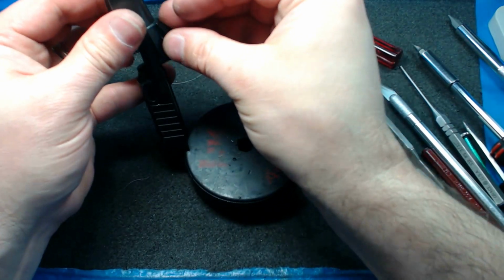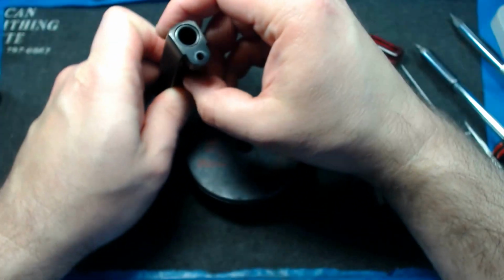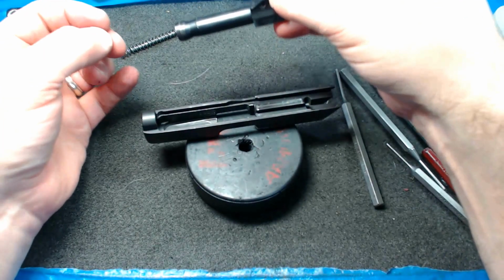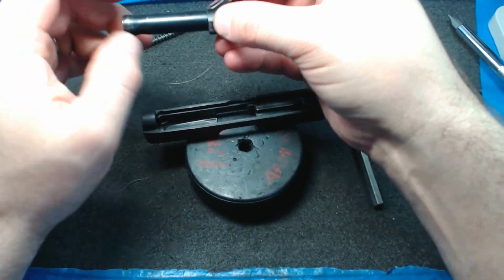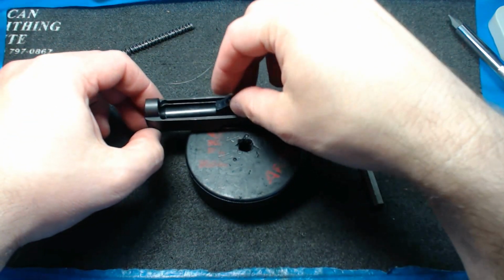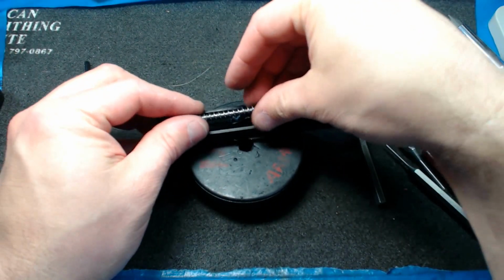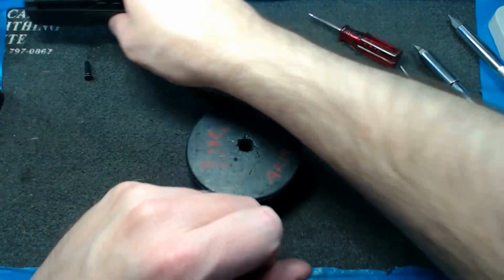Basically, it lets you make it so that this has a much tighter seal to the slide with no actual play, or very little anyway, compared to if it were a perfect cylinder. The shorter your barrel, the more important something like that is. Once you get to a 4 or 5 inch barrel, then yeah, you're not moving it enough to make a difference, but they still make 1911s with match bushings that are really tight there and have a slightly wider end for just that reason. But again, with that bushing, there's not a lot of tipping going on at that point. So anyway, in order to make it so you can actually get this thing apart, that's what that bell design is all about. And so we'll put the captivated spring system back in. Like I said, it's got that cutout in the barrel to hang on to it. And that's our slide.